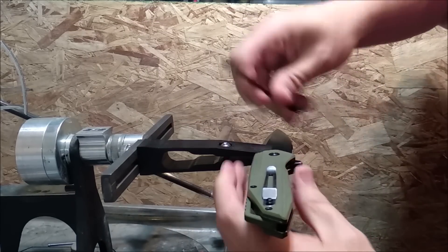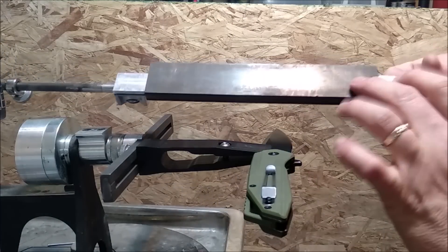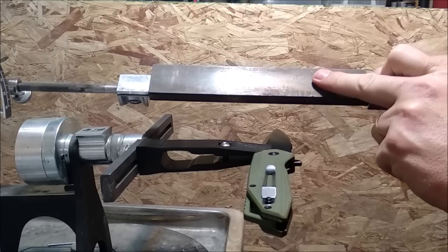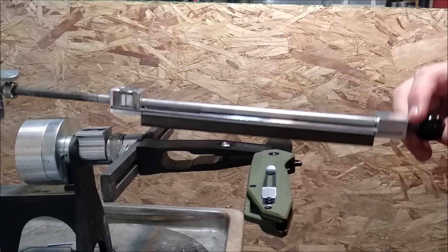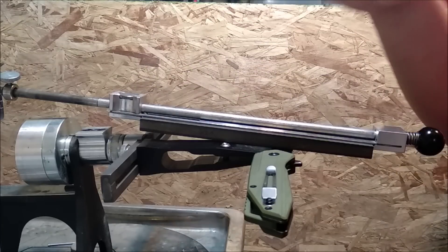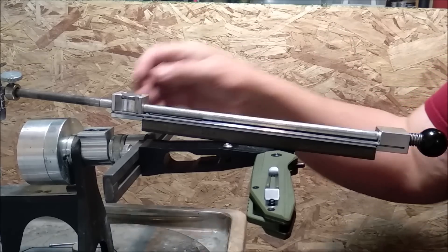Just like I would if I was going to be sharpening the knife, I take a very high grit stone — this is really flat, over a thousand grit. What I do is, just like I find the angle when I want to sharpen the knife, I do a sort of reverse version of that to find this angle. So the first thing I do is adjust it to approximate the angle that I think it is.